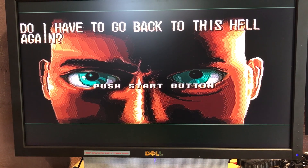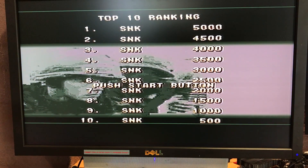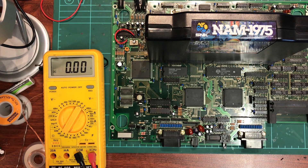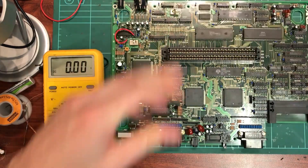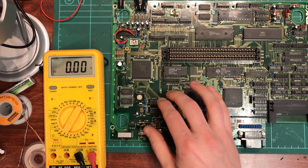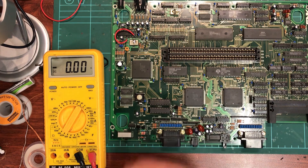Something's going on that's not quite right - yeah, all that shimmer. It's not the end of the world but we need to probably fix that. We've restored power and repaired the palette RAM. To be honest, I would normally do one chip at a time - pull it out, test it, continue. But I had the gun heated up, I've got plenty of spare parts, so I just ripped them out, put new ones in and job's done. I prefer to take high-res photos of the clean board area so next time I can see where all the traces run without removing the sockets.